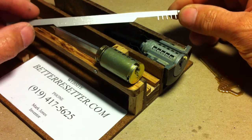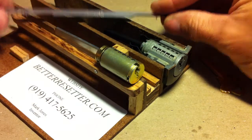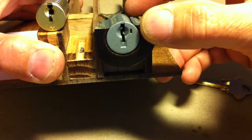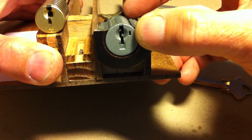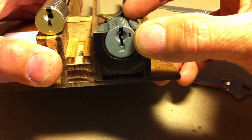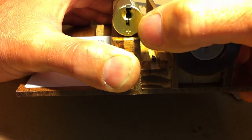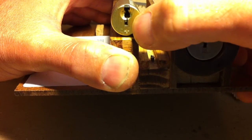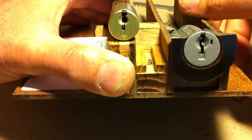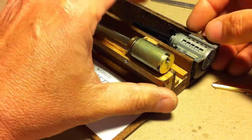This will make the reset procedure much easier for you. The Kwikset design is distinguished by this slit in the face of the cylinder plug — you can see it where my thumb is. When you see that, you know this is SmartKey. On the Schlage product, you can see a plus symbol on the top of the plug; that plus distinguishes it from the pin tumbler designs of the past.